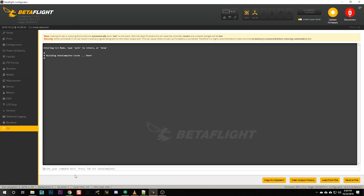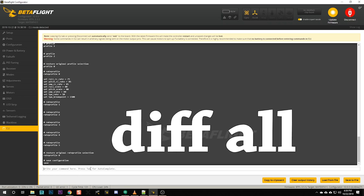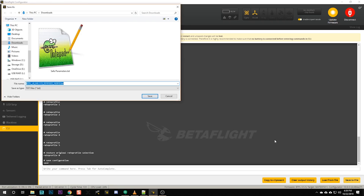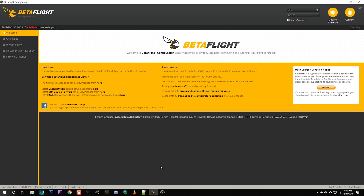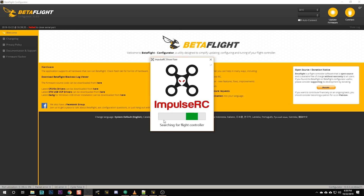If you've done this before, you could probably skip ahead. Go to the command line and type 'diff all' — that's going to output my command line dump. I'll save that configuration dump to a file on the desktop or downloads, wherever. And then I'm going to type 'BL' for bootloader, since I'm in the command line anyway. This is the easiest way of getting into DFU mode to flash the board. If you do that and you don't see DFU, you need the Impulse RC driver fixer, which is an app that will fix your DFU driver.